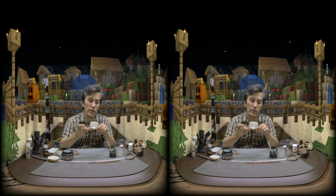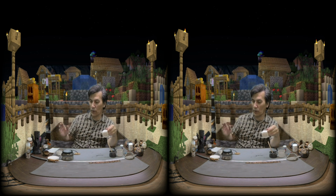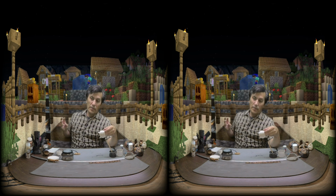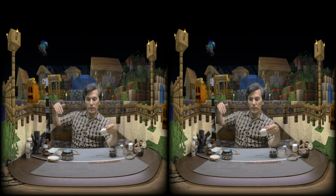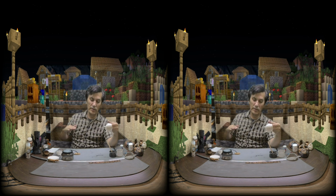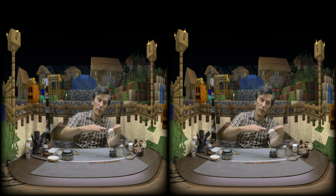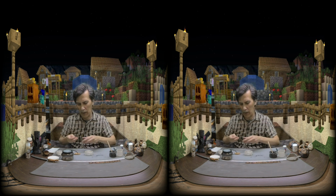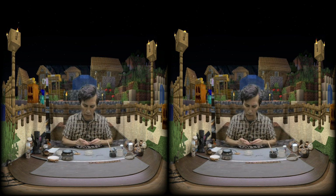This would be considered the cathode, which has a negative charge, and then the anode has a positive charge, which is copper. So copper dissolves in the acid and turns into little ions, and the little ions go to where the cathode is because it's saying stick to me, and they float and they eventually stick on, usually starting where you put your wire. So wiring is really critical.